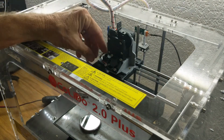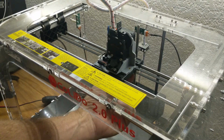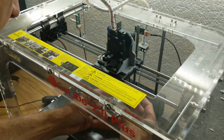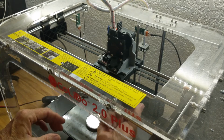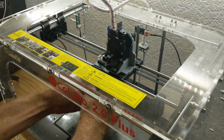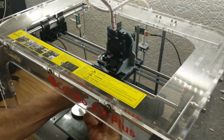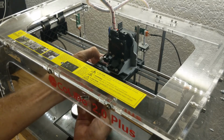Okay, some of those wires got loose, but it still looks all right. Okay, then we are going to drive the screws in from the bottom up. A little hard to see them, so I like to use a little mirror from the bottom, so I can guide my hex nut driver. And once again, my guidance is not too much past finger tight on these is fine, because of all of the slots and so forth that this part makes use of on the carriage. Just a couple of screws is all it really takes to hold this thing in there nice and secure.